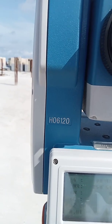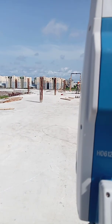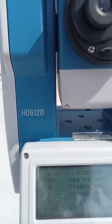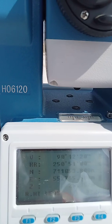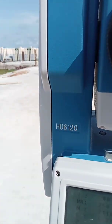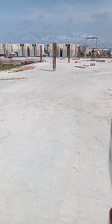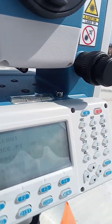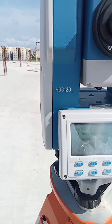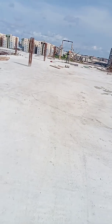On first measurement I have 5mm difference, which I don't accept. I measure again and get 4mm difference. I confirm the coordinate values: northing 7110053.809, easting 552765.588 — we're good. I press Enter. The orientation is complete. My acceptable error range is 0 to 5mm; anything beyond that means something is wrong and I redo the orientation.